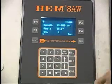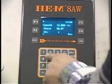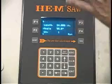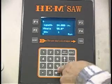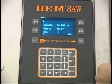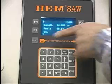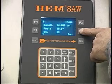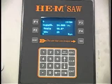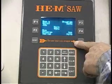It asks you three things: it asks for a length, an angle, and how many parts you want. If you want a part that's 24 inches long, press enter. It'll ask for an angle — if you want straight 90-degree cuts, tell it 90 degrees and press enter. It'll ask how many parts you want; we want 25 parts, tell it 25, and press enter. Then all you have to do to make the thing run is push run — which I won't do because this machine is not finished. To bail out of the program, push escape and it goes back to the main menu.